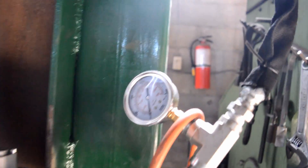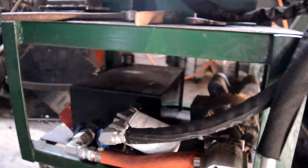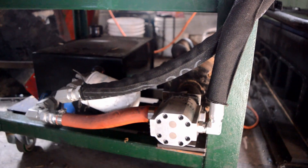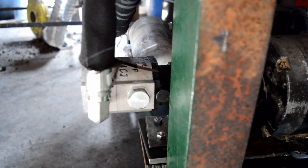I have a pressure gauge here on the press. On the bottom of the press I have a five-gallon reservoir — I bought the economy one, so it was $100. Moving on, there's a two-stage gear pump. This is a five-horse gear pump and the two stages are 3 and 11 gallons per minute. The gear pump cost $150.